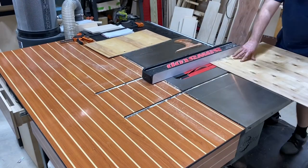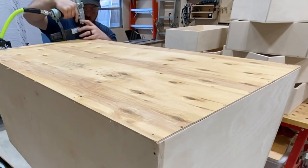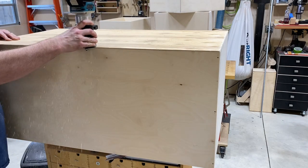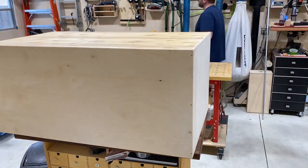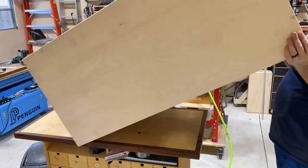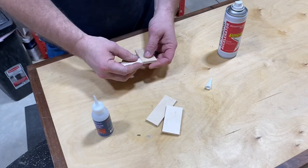This is an eighth-inch piece of plywood that comes in between the Baltic Birch when I order it. I'm using it as a back — I'm sure you could buy some door skin or a piece of Luan at the hardware store. I'm taking it and I'm going to flush trim all the way down and put a slight bevel on it as well. Once the back is on, I check for no blowout. Once the back is on a piece like this, it really does give it all that stability and rigidity that it needs — it's amazing how it just transforms its strength.